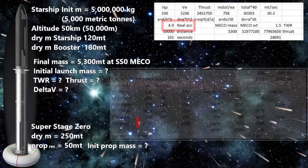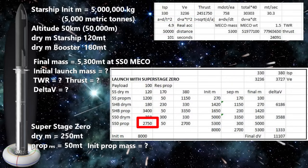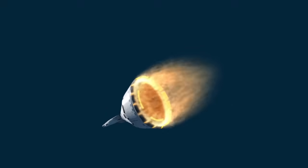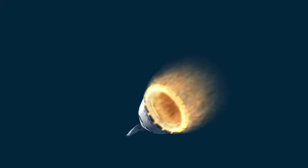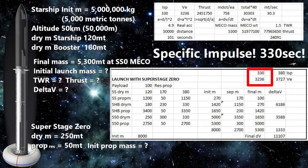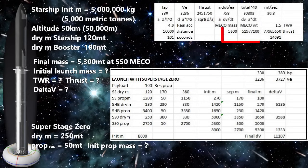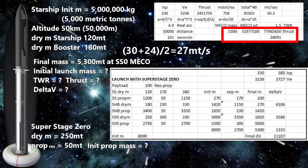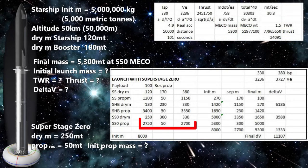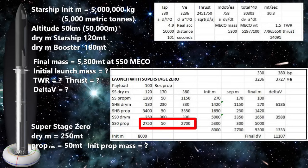We had 2,750 metric tons of propellant. As we climb, we burn propellant mass, allowing us to throttle down the engines and reduce our mass propellant flow. If we reach apogee with 300 metric tons for super stage at MECO, our final mass would be 5,300 metric tons. Assuming an exhaust velocity of 330 seconds — actually a little better at lower atmospheric pressure up here — we would need to burn only 24 metric tons per second. The average between 30 and 24 is 27 metric tons per second; times 101 seconds gives us 2,727 metric tons of propellant, not counting what we saved using the jets. Since we started with 2,750, and with jet engines increasing efficiency at the very start, we should have enough propellant for our 50 tons of reserve.